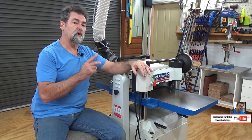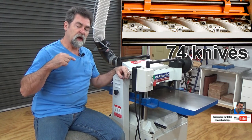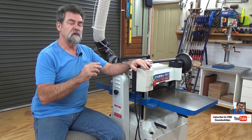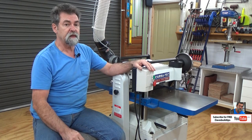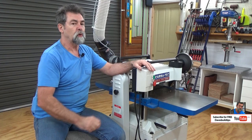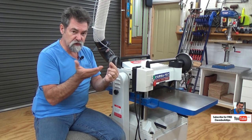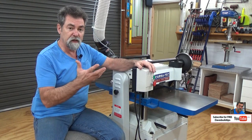Talking about the knives, they are all on a helical head. This machine has a 15 inch long helical head and all of the knives are placed around it. Each knife has four cutting edges, so they last a long time. When one becomes dull or I strike a nail, all I have to do is mark the knife on the dull cutting edge with an indelible pen and rotate it a quarter of a turn. Undo the torque screw that holds it down, rotate the knife a quarter of a turn, make sure the seat is still clean — it's a machined head. Tighten it back up with the torque screwdriver and you're cutting again.